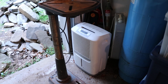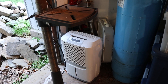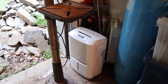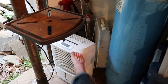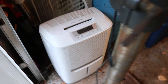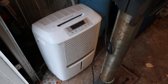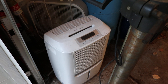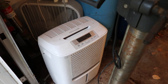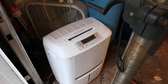That is why I have a dehumidifier in here. This is central Connecticut, which gets like a rainforest — at least in the summer — and gets very cold at night, so it's very easy for water to condense on the metal. If I don't have this dehumidifier, things rust pretty readily. This particular model has a digital humidity setting, so you can set it to whatever makes sense. You get a feel for it — set it to 70, let it run, then come back and adjust by feel.